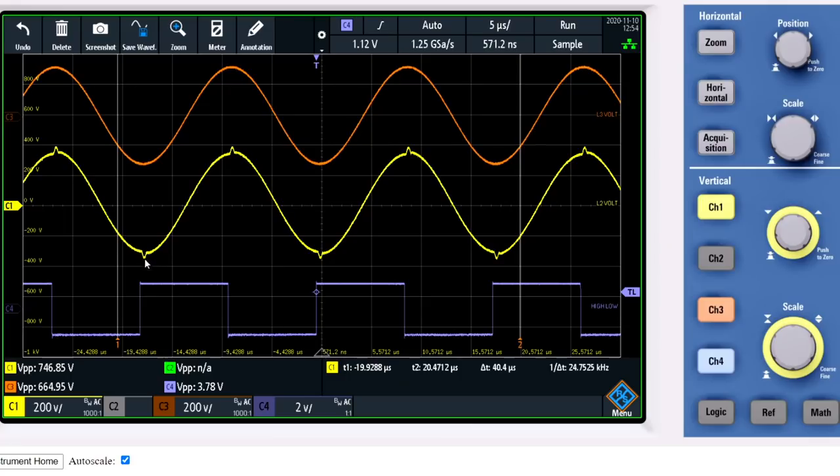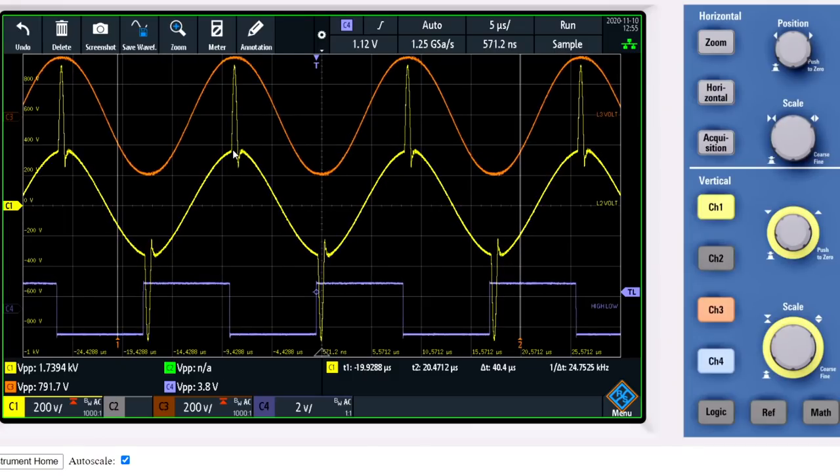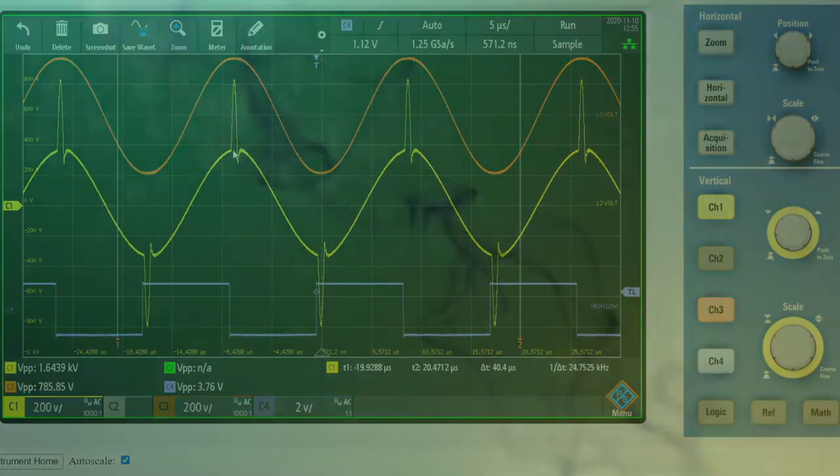Furthermore, it can be seen that the L2 voltage now, by distancing the L1 and L2 coil, is in phase with the impulses again. I will dial in the impulses now so you can see them. Here they are. And as you can also see, the amplitude is rising again when I inject the impulse. So the distancing of L1 and L2, loose coupling them, has fixed the anomaly.